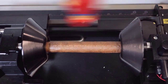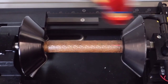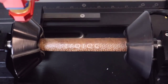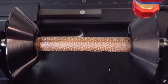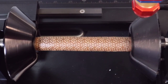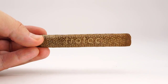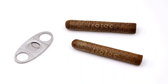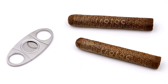Now let's run a more complicated 360-degree engraving test using these settings on a rotary to see if this is also possible. As you can see, running even a four-inch lens with the rotary produces a very consistent 360-degree engraving all the way around the cigar, producing an outstanding finished result. The productivity is very good due to the fact that we're only running at 250 DPI around the graphic.